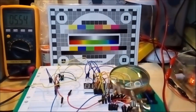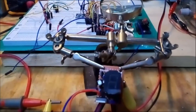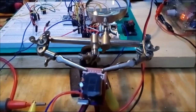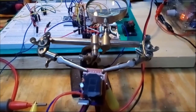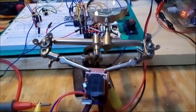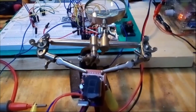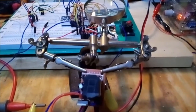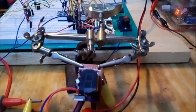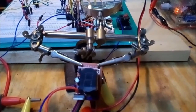Now, technically, I could go to 6.2 volts with the little light bulbs I installed, so the replacement bulbs. Unfortunately, the original light bulbs that are still inside the display can take only, say, about 5 volts, yeah, which is TTL level voltage. So I will push them to 5.5 volts, but I wouldn't advise pushing them any harder.